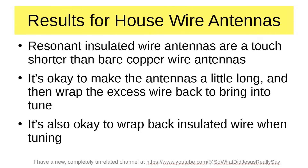So there you have it. We took a look at an interesting question: a bare copper antenna versus an insulated one. The insulated one ends up being a little shorter simply because the velocity factor in insulated wire is slightly slower than in bare copper wire. We also showed that if you take an insulated wire and wrap the excess back on itself, it acts the same as if you cut that excess off — it's a good place to put the excess and doesn't create any weird impedances. This is for HF antennas, 160 through 10 meters. Antennas are very easy to make and are very often the only part of a station that a ham can make. So until we next meet, 73.